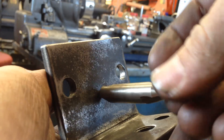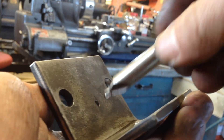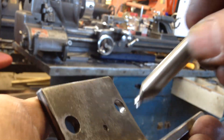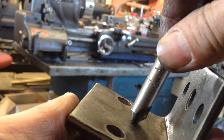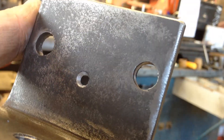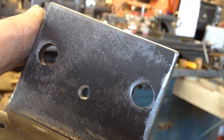What I'm going to do, if it will clear — I'm afraid the chuck won't clear — is take it over the drill press and see if I can hold the angle iron in the vise and drill it that way, because now that's centered. It worked! Now I can put the lathe center in there and know I'm right on.